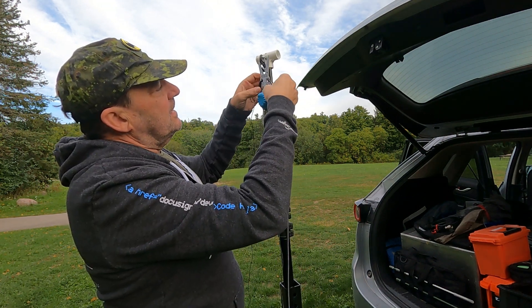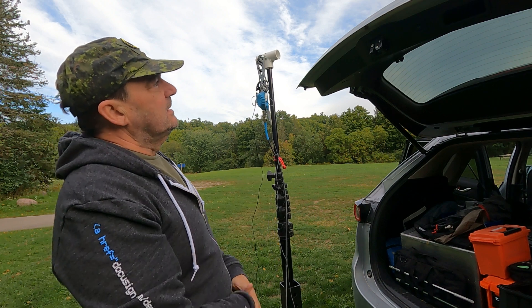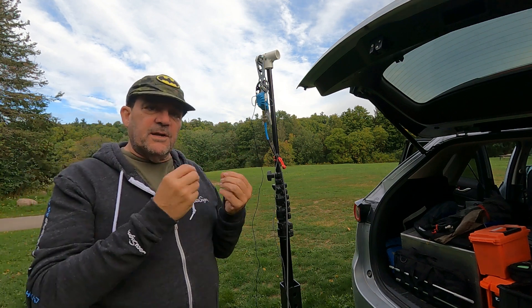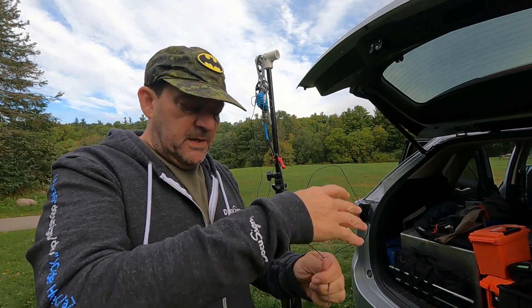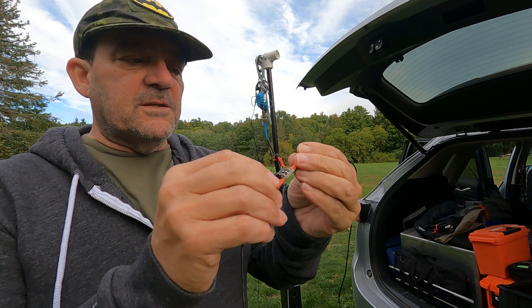I've got two carabiners on it, I've got the two wires linked in, I got everything laid out. And this is basically a one-to-one balun — great form factor. The linked dipole has 20 meter and 40 meter legs on it. There is a little switch that you open and close in order to add in the different legs. Works very, very well. I've been using this for quite some time.